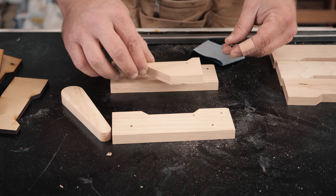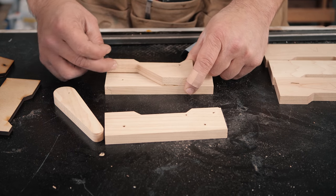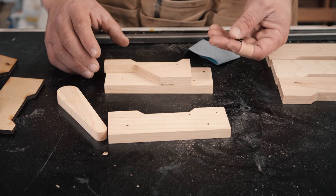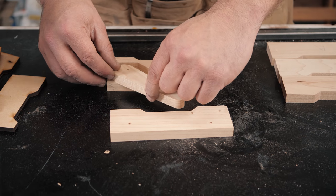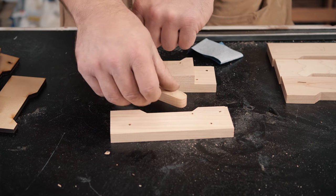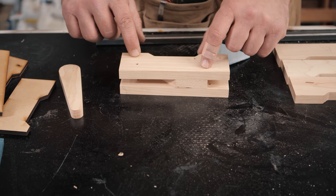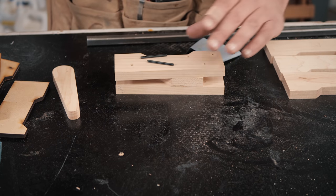So the way that this goes together is this hole right here, you gotta remember, is your kerf, and that's gonna get cut right under there. And that's so that the wood doesn't split. So you do not wanna put a pin in there. You could use an 1/8 inch drill bit for alignment if you need to, but you don't want to leave a pin in there. And then you're gonna put in your cantilever lever. And you wanna make sure that the fat side is facing out, because that's gonna rotate on your pin and it's gonna push your clamp up. So we're gonna put pins in three holes. 1, 2, 3. And then we are going to go ahead and glue up our top fixed jaw.